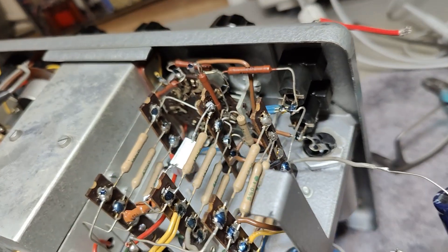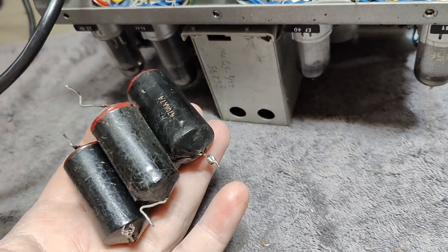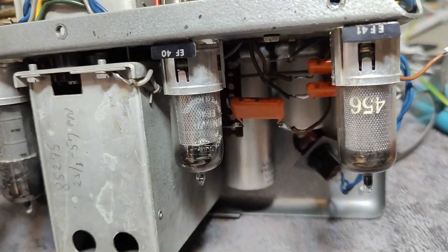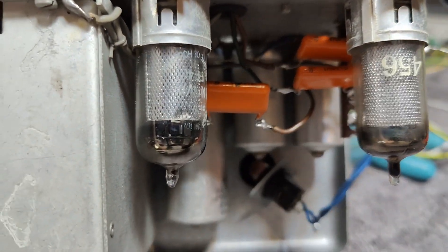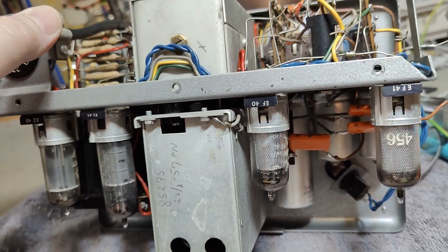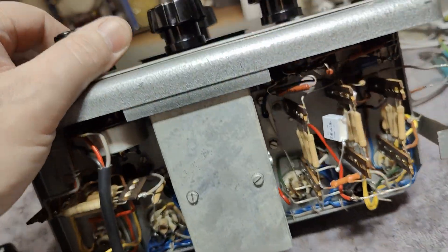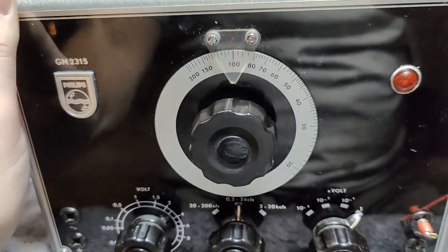I feel I want to give up for now. I've changed all the capacitors and everything - all the resistors work, all the voltages work, everything seems fine, but the unit just stopped working. That little clickety sound I heard - I think it is one of the internal welds inside one of the tubes that opened up, which is why nothing works. I want to go play with some other Philips units from the same era that might contain some of those tubes so I can carry on. Thank you very much for watching. Bye bye for now.